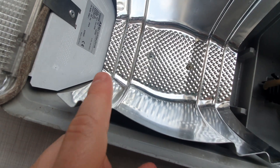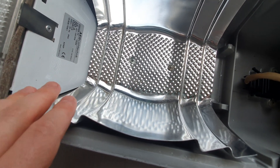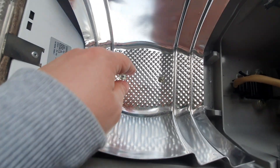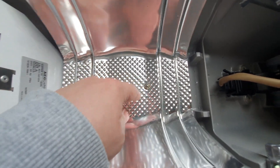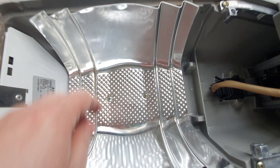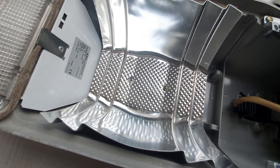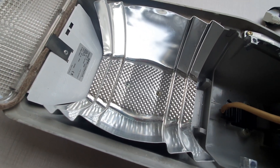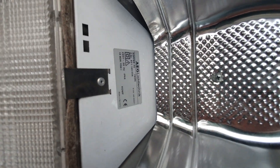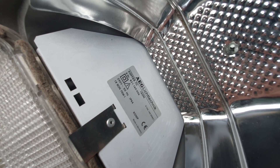In the lamp compartment we have this beautiful reflector that has steps in it so that it doesn't take too much space of the lamp chamber. On the bottom there is a perforation that throws the light — the light that goes down from the bulb — more to the side. It's a really neat reflector that works really well.